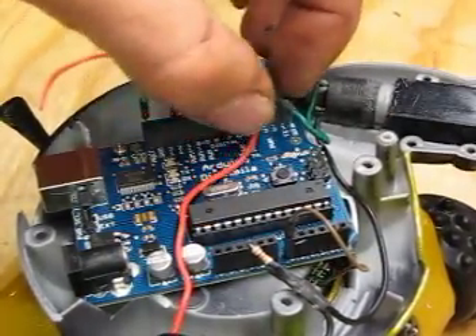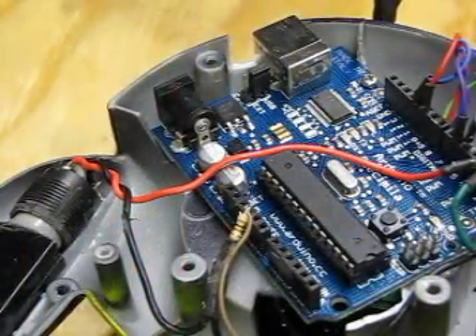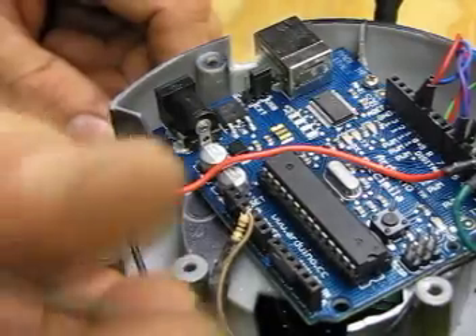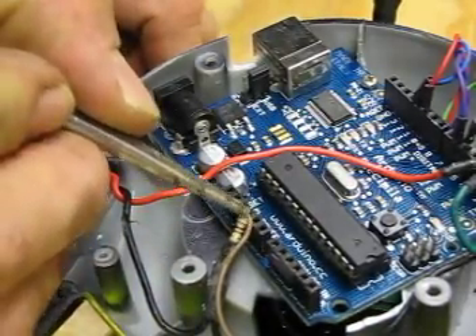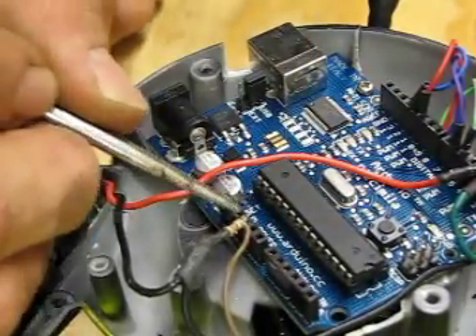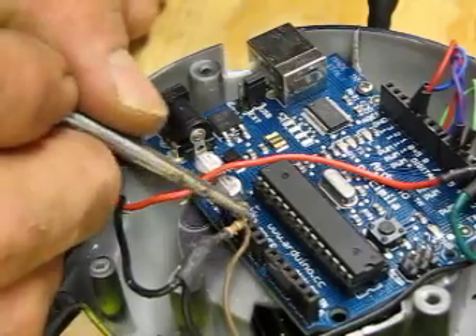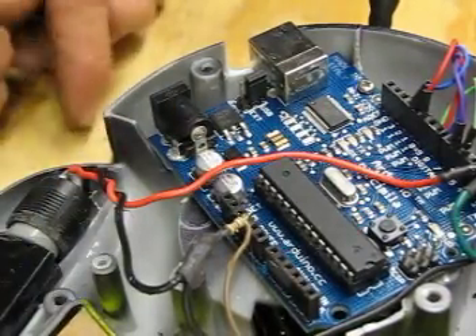Now we'll put all these in the proper places. By the way, I soldered the ground wire that comes up from the motherboard right here into the downstream side of the resistor that goes into the ground on this side, because this is the ground on the input side — that's where we want that.